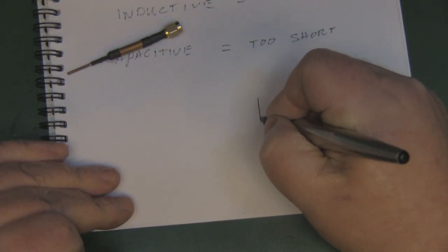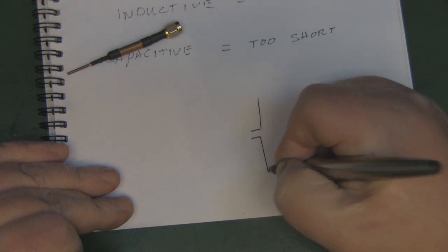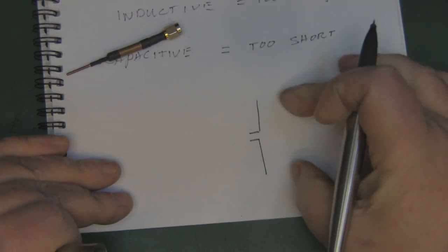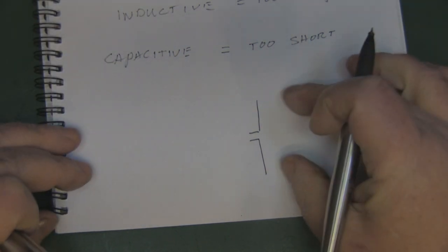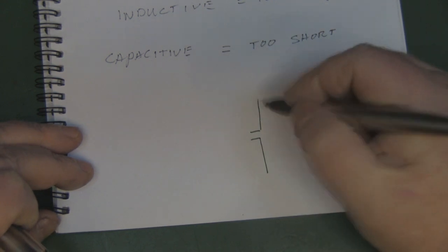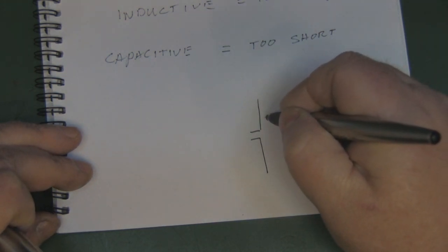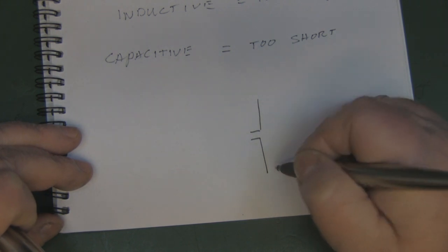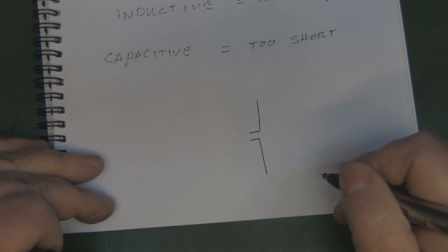Now, I've also had people say over the years that this is not a dipole antenna, and they tend to reference this kind of dipole antenna when talking about a dipole antenna, and this is a dipole antenna. This particular design is not capacitive in any way, shape or form, so you would normally see quarter wavelength here at around 31.5 millimeters and a quarter wavelength here at around 31.5 millimeters for 2.4 gigahertz typically.